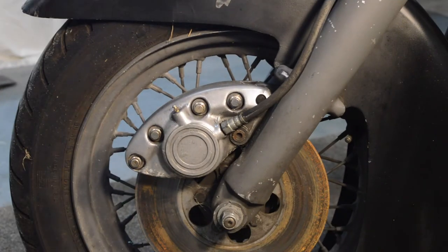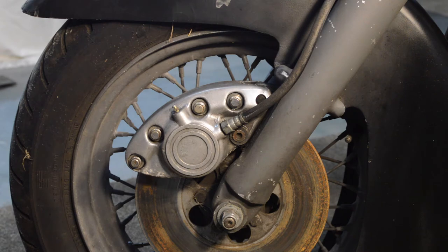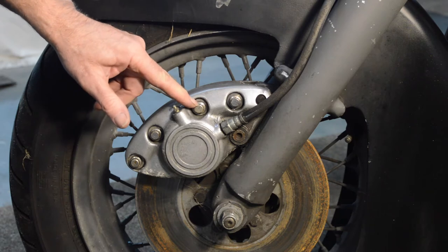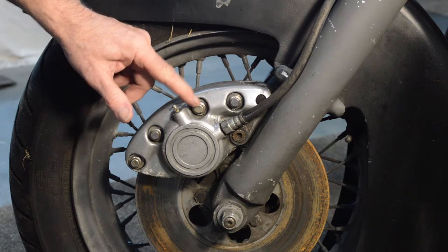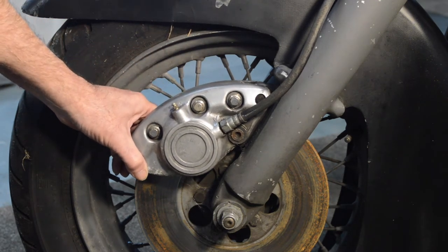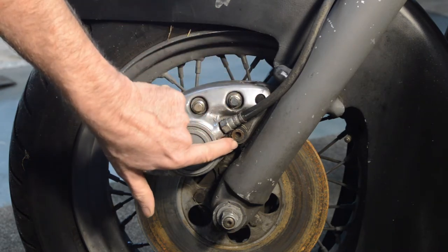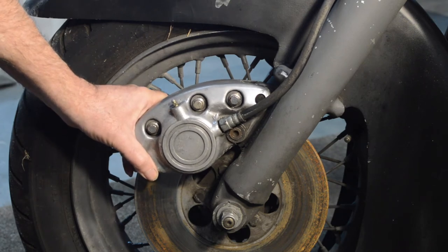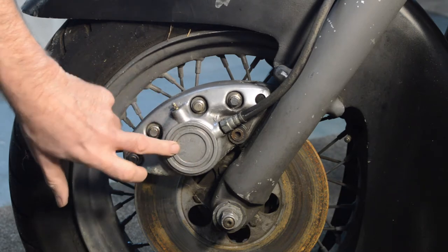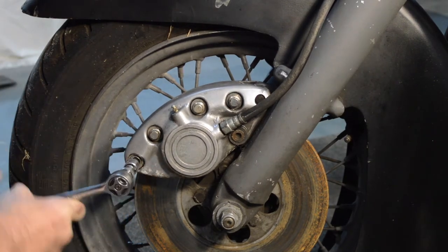Let's look at this banana caliper now. I'll just crack that so I can remove it more easily. Getting the caliper off — the caliper-half securing bolts are 12-point. I was wrong about the movement at the top; there's a small amount, and this main pin here is clearly suffering badly. That's ridiculous — that's where our problem lies. I'm going to get this off and see what lies beyond, because I've never taken one of these off before.